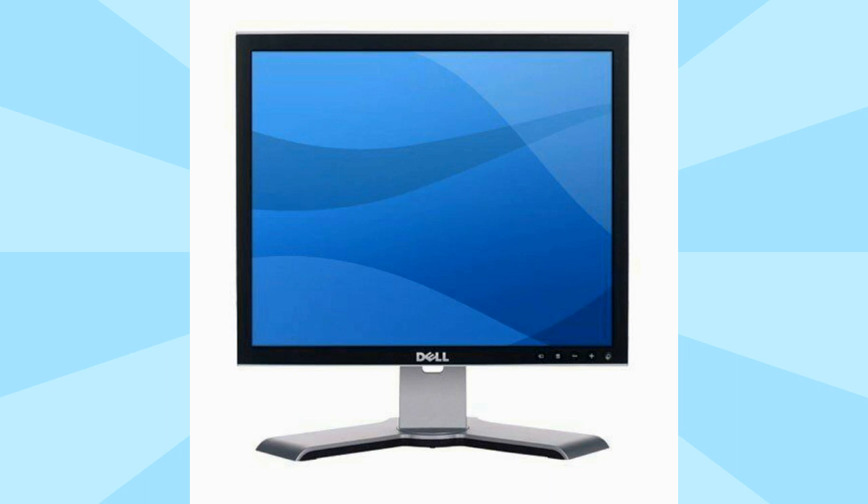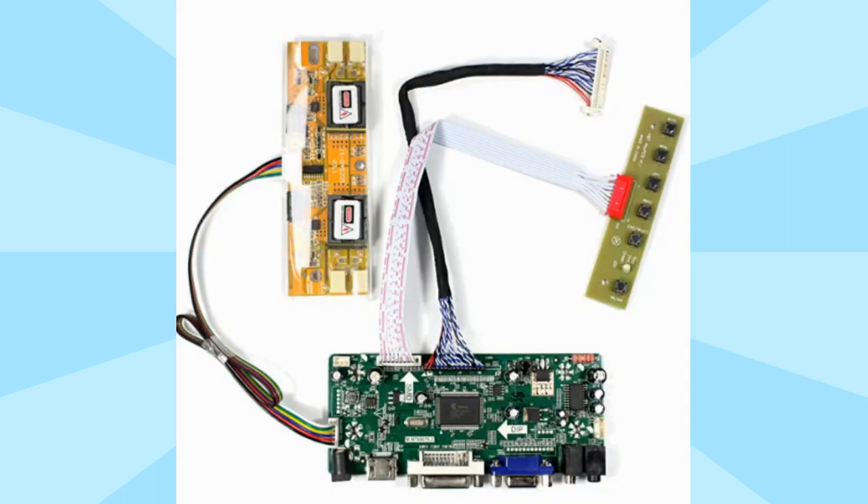The first step: my first mod was a Street Fighter 2 and I had followed directions from ETA Prime's video. I got those parts back out — I had them stored because I had taken apart my Street Fighter 2. I got the LVDS cable because I figured, since this is set up to work with it, it may work with the actual Arcade1Up. If I swap out the cable that's in the Dell — the one plugged into its LCD controller board — I can take that cable out, plug it into the monitor, and then put that directly onto the Arcade1Up PCB.